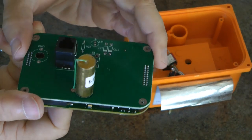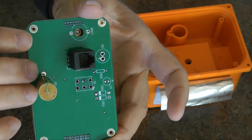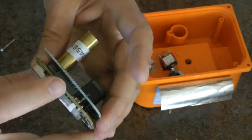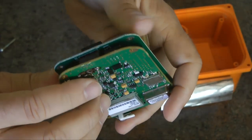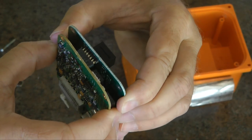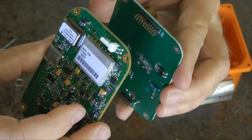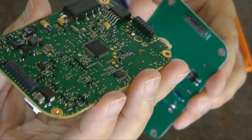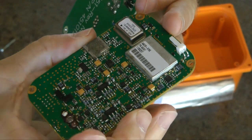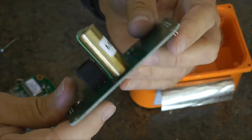The cylindrical object is the ELT's G-switch, and we'll talk more about that in a moment. That turns the transmitter on and off in a crash. The black box in the middle is the connector for our remote unit to arm the unit remotely. Actually, this is two circuit boards, and there's a connection at each end - so this should just pull apart. There are connector pins at each end. In fact, this is two circuit boards matched together with a connector at each side. This circuit board is double-sided with lots of parts and pieces on both sides, because this is actually a transmitter transmitting on two frequencies - 406 MHz and 121.5. And this board here is just for holding the G-switch.